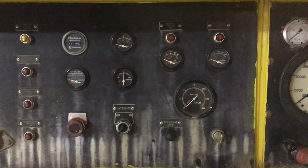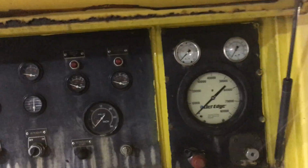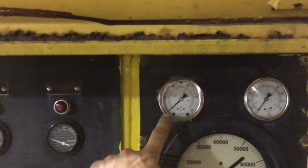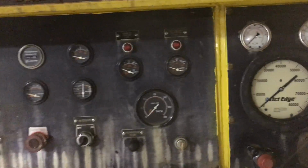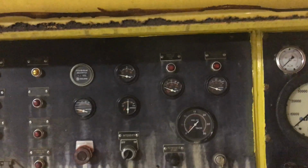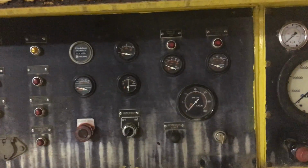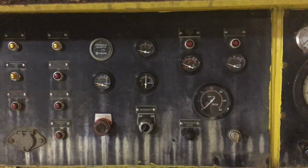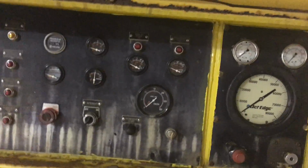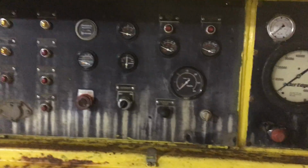And of course, this all assumes that you have a minimum of 60 psi of water inlet pressure, which you can read here in this gauge, going into the machine. And you have all of your high pressure outlet hoses hooked up to whatever accessory you're using. If you're using a hand lance or a hand gun in order to jet something or to clean something, all that would be hooked up.